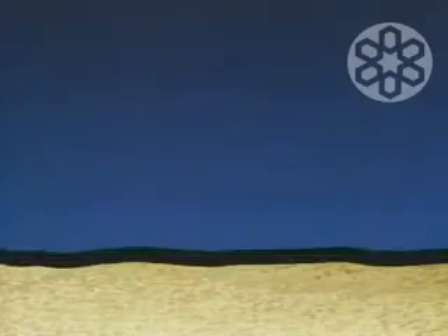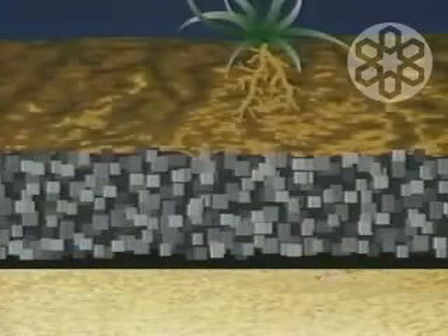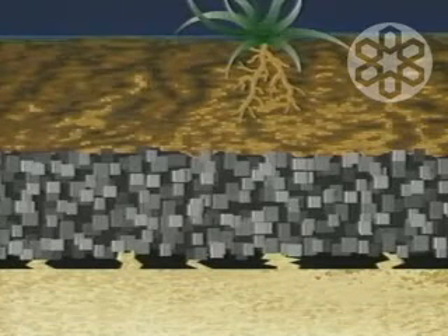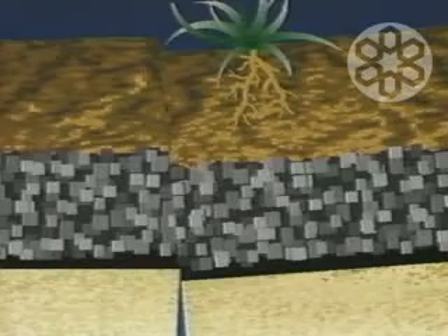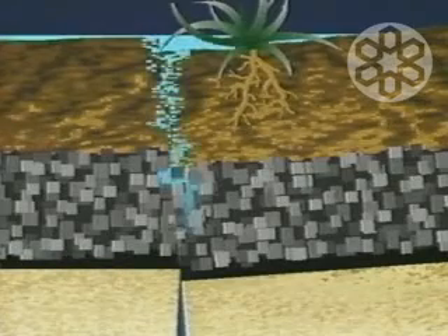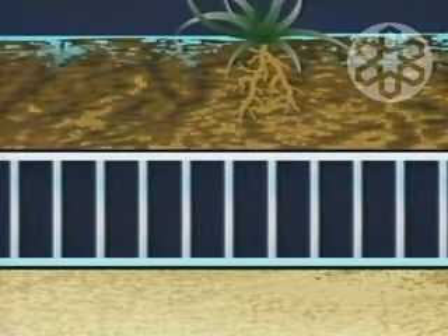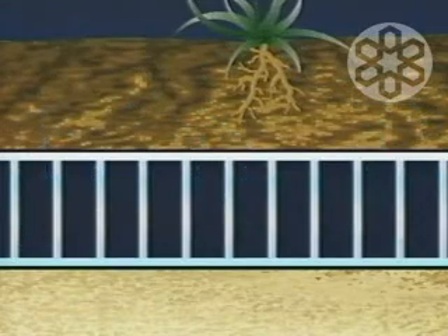The conventional system saw plastic sheeting laid on the roof, followed by gravel and then the soil. It was inefficient for several reasons. The gravel would tear holes in the plastic, allowing water seepage. The tremendous weight of the gravel could also cause cracking of the concrete — again, water seepage occurred. However, the lightweight cells support the weight of the soil and allow the water to drain away, all without breaking the waterproof membrane.